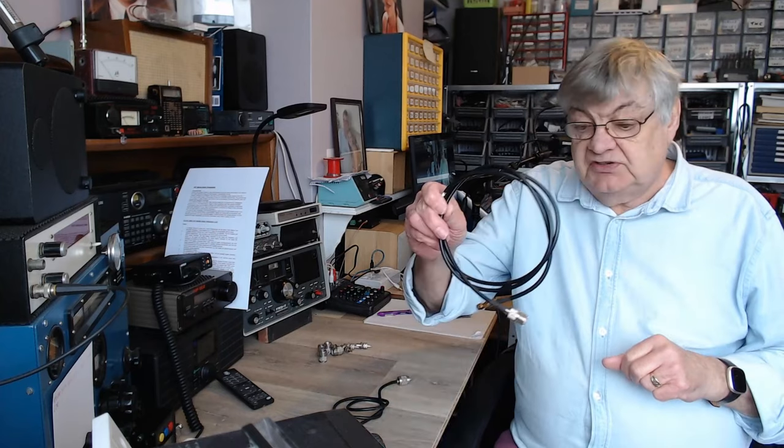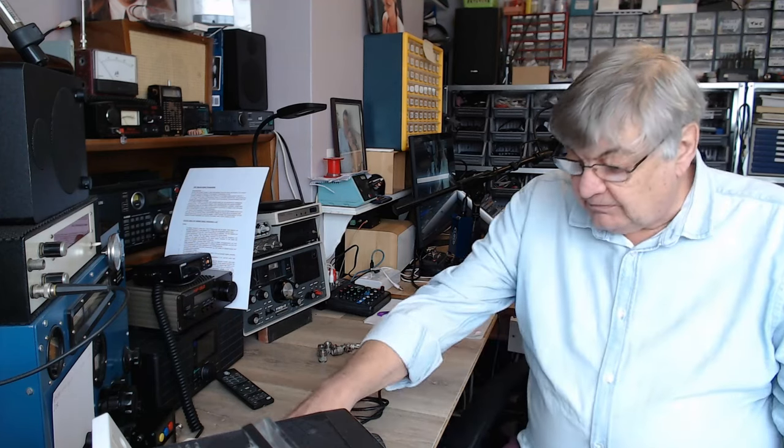On my 6-meter aerial I ran RG-214 — about 100 feet. I used to use the RG-8X mini. Signals have come up because the 214 is better, but also the noise has gone down. It was picking up some local noise, perhaps in the attic, and there's a noticeable reduction. That's what the double screening is all about — both shields are silver-plated, so is the inner, which helps with loss too, but the main purpose of the double screening is EMI: keeping it out and stopping it radiating.